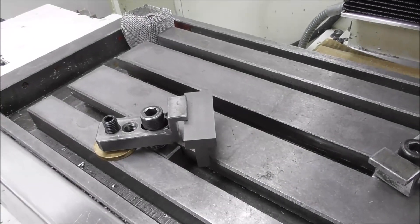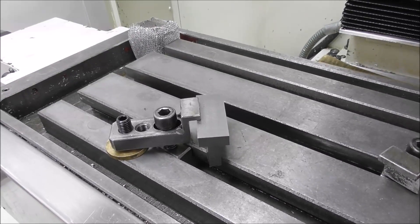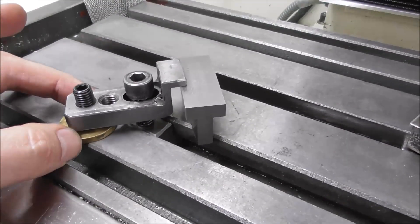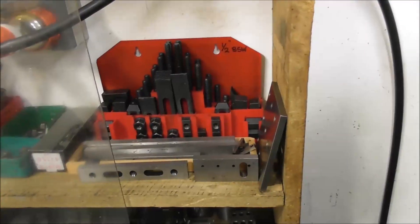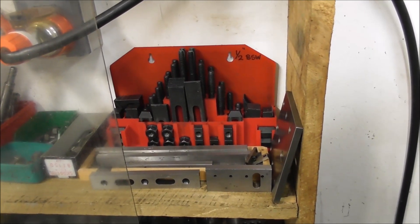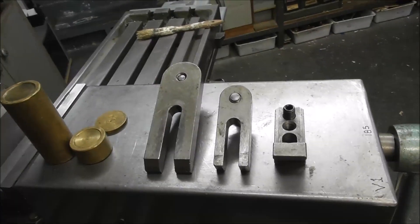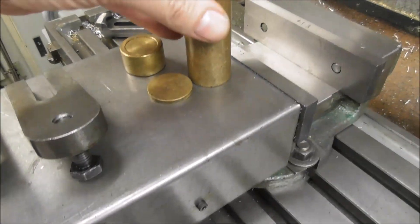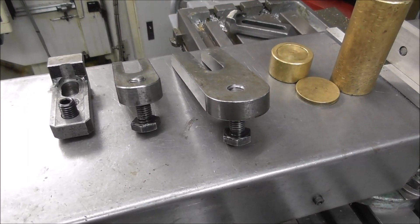Many years ago I read a book from Moore Tools called 'Precision Hole Location' — some of you may have seen it. They're a manufacturer of jig borers and other precision machinery in the US, and I really like the design of their clamps, so I copied the fundamentals: a set of little brass protection blocks, a thread at the back, and a slotted hole at the front. Most of you will be familiar with the cheap Chinese clamp sets — they're really good value and a good starting point, but the Moore Tools design system is more elegant and versatile. It has adjusting screws at the back and you just need to make up a few sets of soft metal packers for coarse adjustment, with fine adjustment from the threads. Thanks for watching — I hope your coffee lasted to the end. Catch you next time.